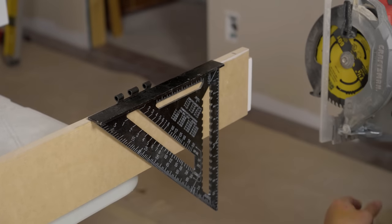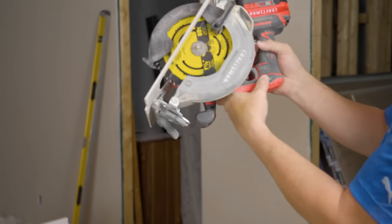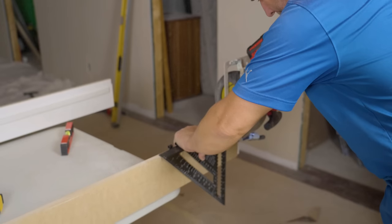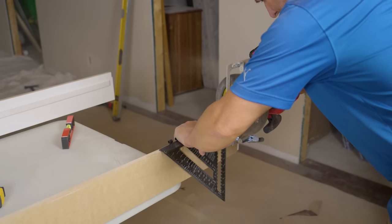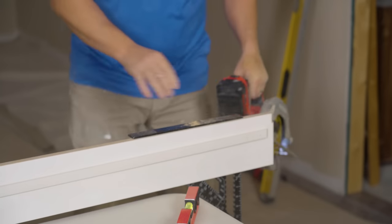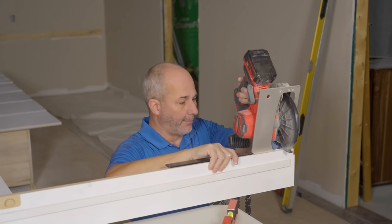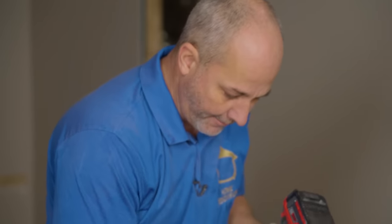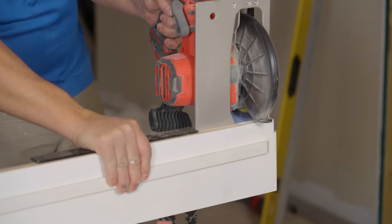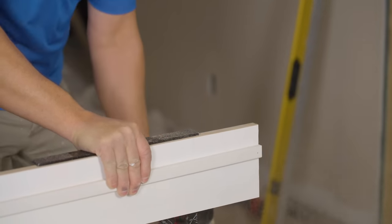To cut this, we're going to use our triangle to create an inverted table saw. There's my spot — I'm going to pinch that. In order to get this going, I've got to pull the safety because I'm using it upside down backwards. Then the same on the other side, only this one I've got to go backwards. I'm just lining up where my saw blade touches my pencil. When I do this, I'm only focusing on the square and this blade — I'm not looking at what I'm cutting.